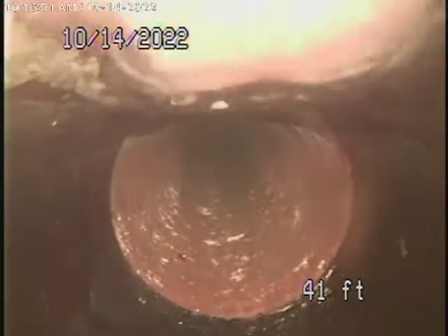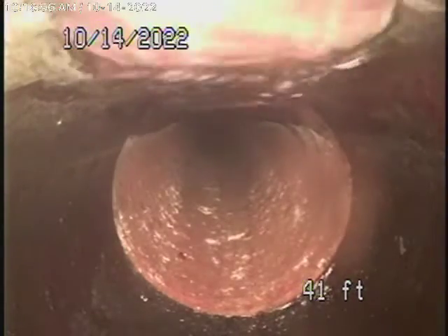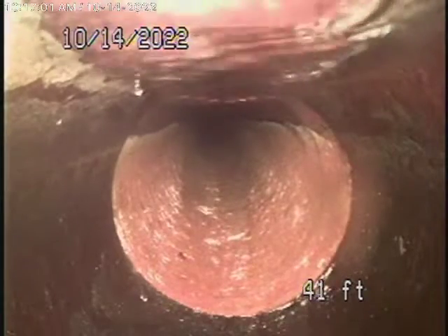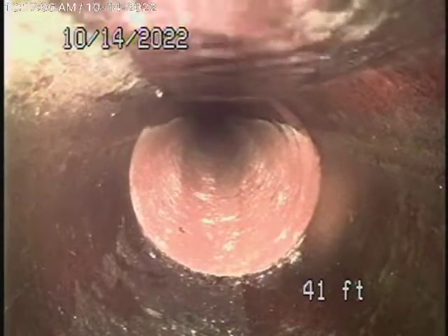Here it comes out of the clean-out over here in the front of the house. We've run our camera from this 2-inch clean-out located here behind the kitchen sink. There was a little bit of grease in the line, but we flushed it through and cleaned it up with our camera. We just wanted to check the main line that runs underneath the house. The house is on a slab, so make sure the general inspector runs the water everywhere. We're now outside of the house and into the clay pipe.